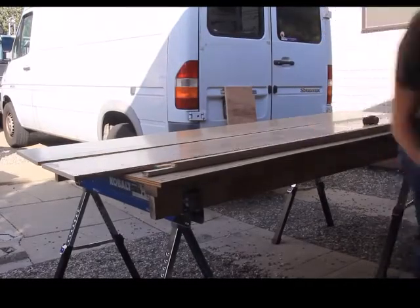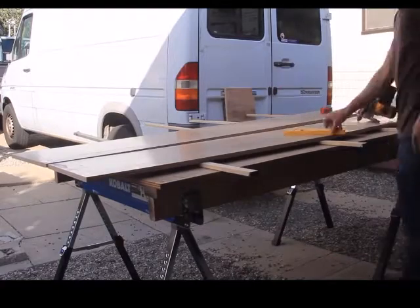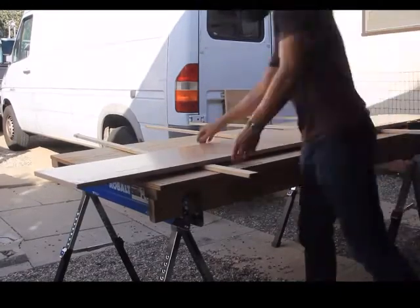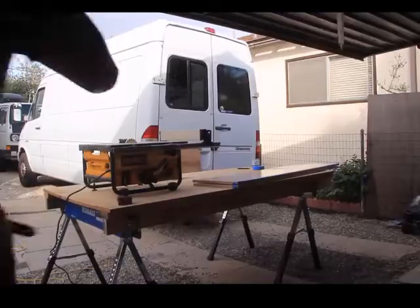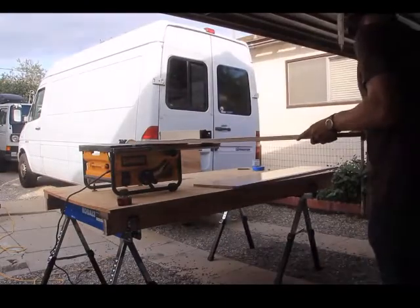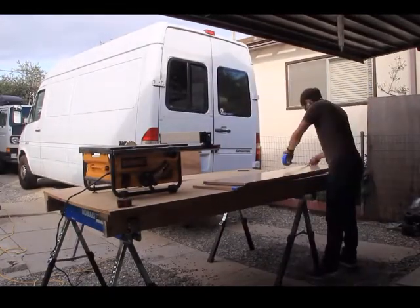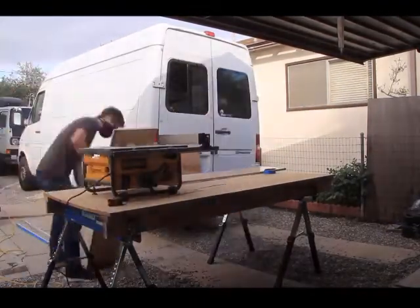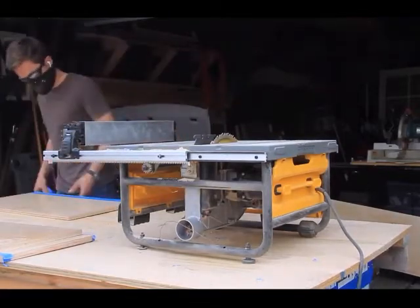From there I went ahead and cut everything down to the proper length. Once I had cut everything down to the proper length and width — or at least the rough width — I went ahead and took out my table saw and finished everything up with the straight edge on the board. As you can see, I used some masking tape to tape off the section I would be cutting. This helps prevent the chip-out that happens with this pre-finished plywood — it happens even more with this plywood because that top layer is super finished.